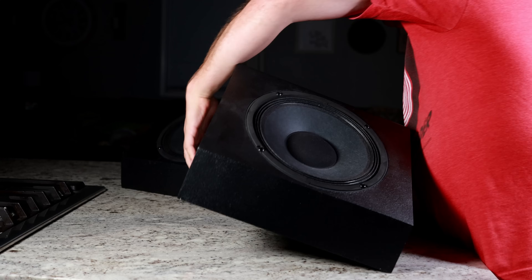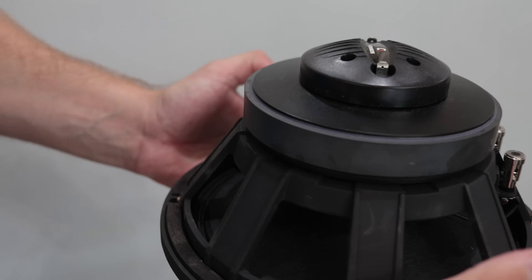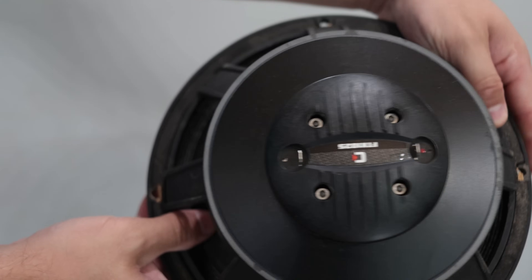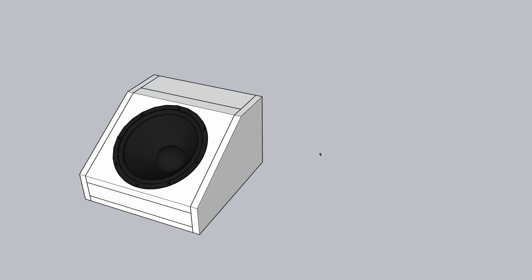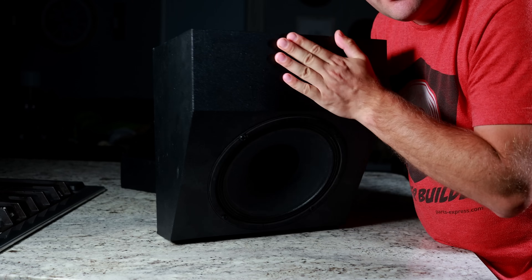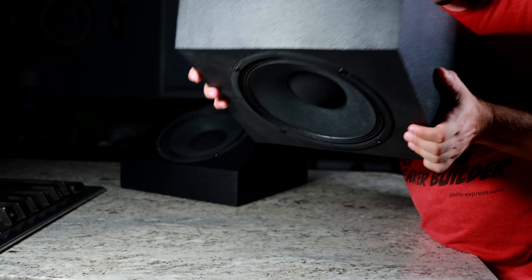I want to come in right around $300, so this is perfect for our budget. Both the parts and the build plans will be in the description of the video. The compression driver is mounted directly on the rear of the driver, which minimizes the depth of the speaker — really important for the way we're going to design this box. I decided to design it with a slanted look so you can use these for rear speakers or for on-ceiling Atmos-style speakers.